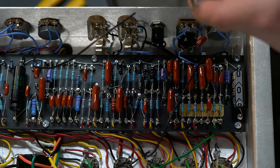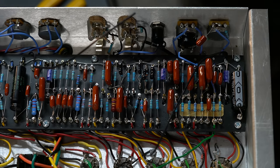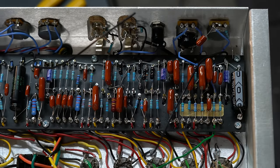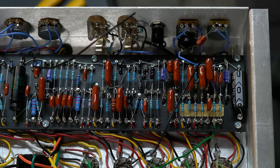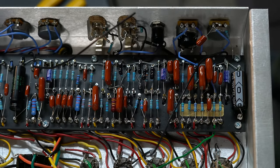Another thing I've learned through experience is that any wire sitting exposed to the air tends to build up oxidation, which makes it hard to get a good solder connection. So I'm going to take a small amount of sandpaper and sand the length of this to remove any oxidation — just a little fine grit sandpaper along the whole length to shine it up so it will accept solder a lot better. I've had problems where I had bad solder connections, reflowed them and they still wouldn't work, but once I scraped them up it started working much better. So I'm removing as much oxidation as I can.